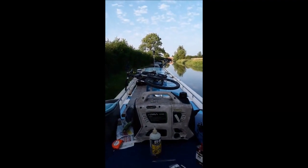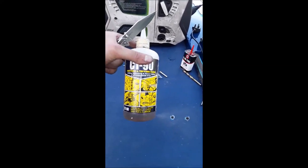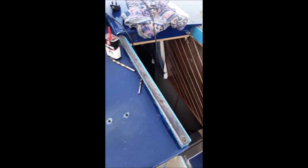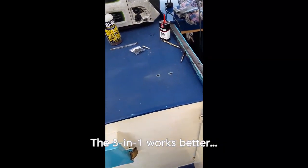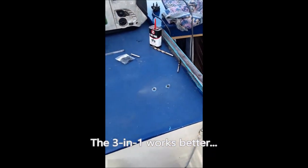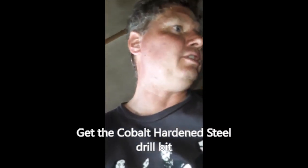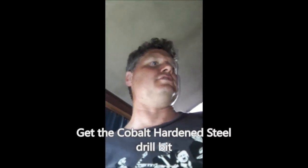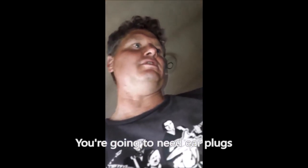A person from the next boat down who works at Midland Chandlers brought me this cutting and tapping fluid, because I was drilling away and it was taking forever. You need cobalt drill bits — cobalt metal drills, hardened steel drill bits. And even they take ages. I use these Draper ones, which work alright, but it just takes a while.